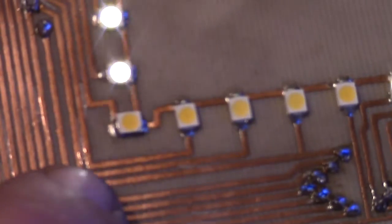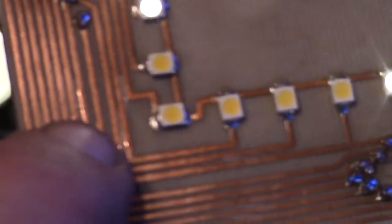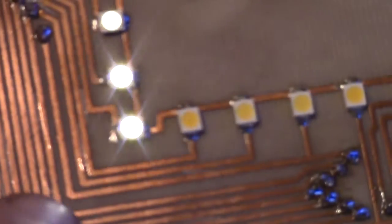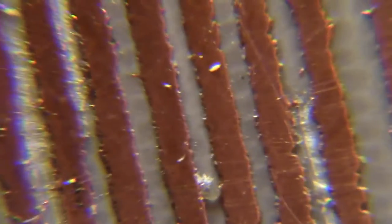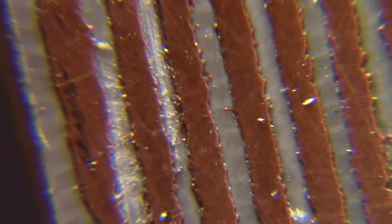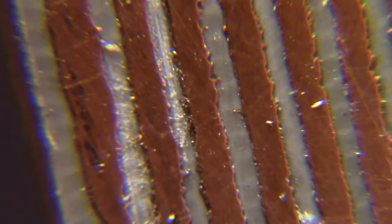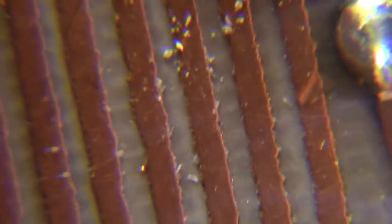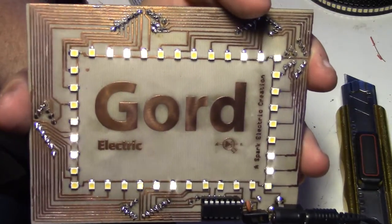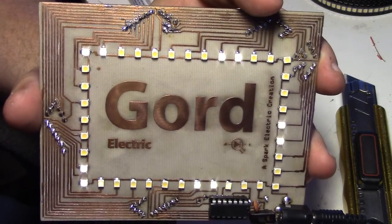You can see I've been scratching away at some spaces between the traces because there were very small spots that were shorting. Right in the middle of the board there's a little piece of copper coming out — sometimes that will stretch across and short the traces. You can't really make traces any closer than a certain minimum or any thinner. Beautiful — I couldn't be happier about that.